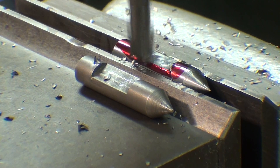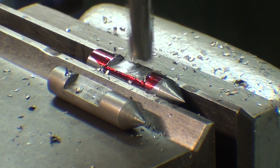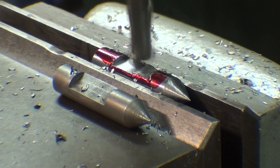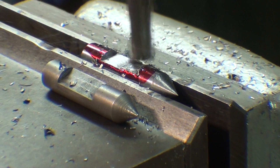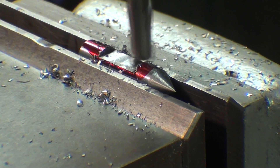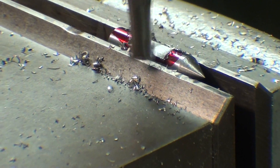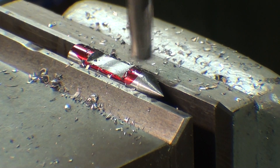And now I'm raising the table to seventy-five. I'll take it right down to those layout lines, lengthwise. This is a carbide cutter — I'm only using it because it was already in the mill. This length dimension for the flat is not very critical at all. And that's all there is to that.